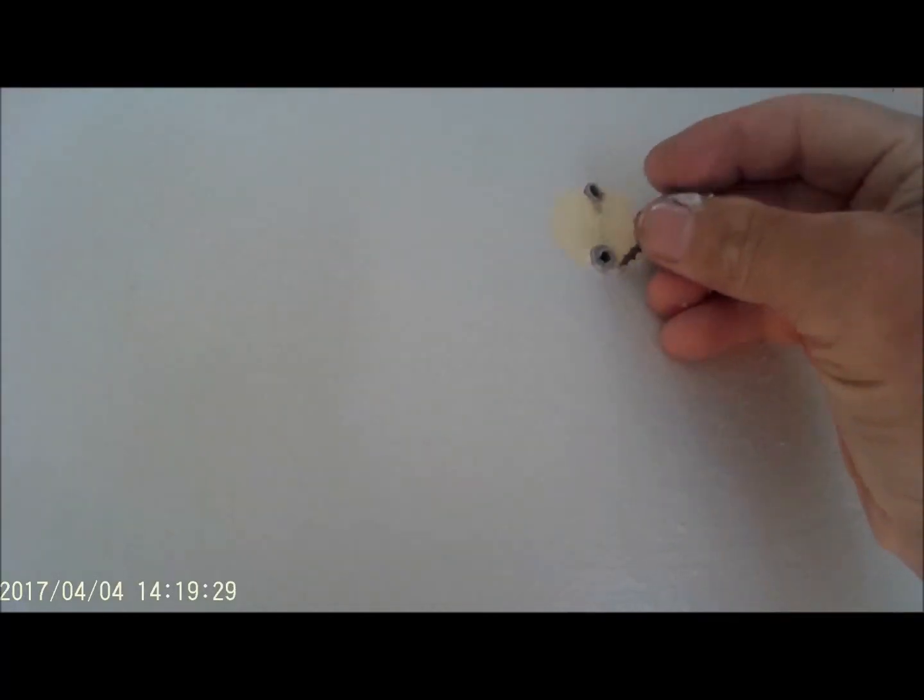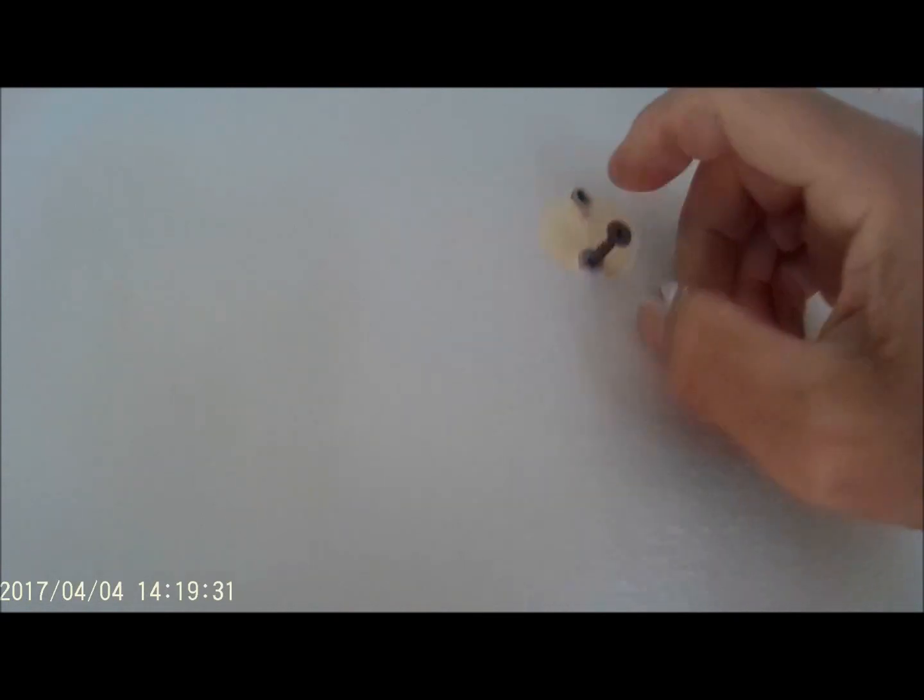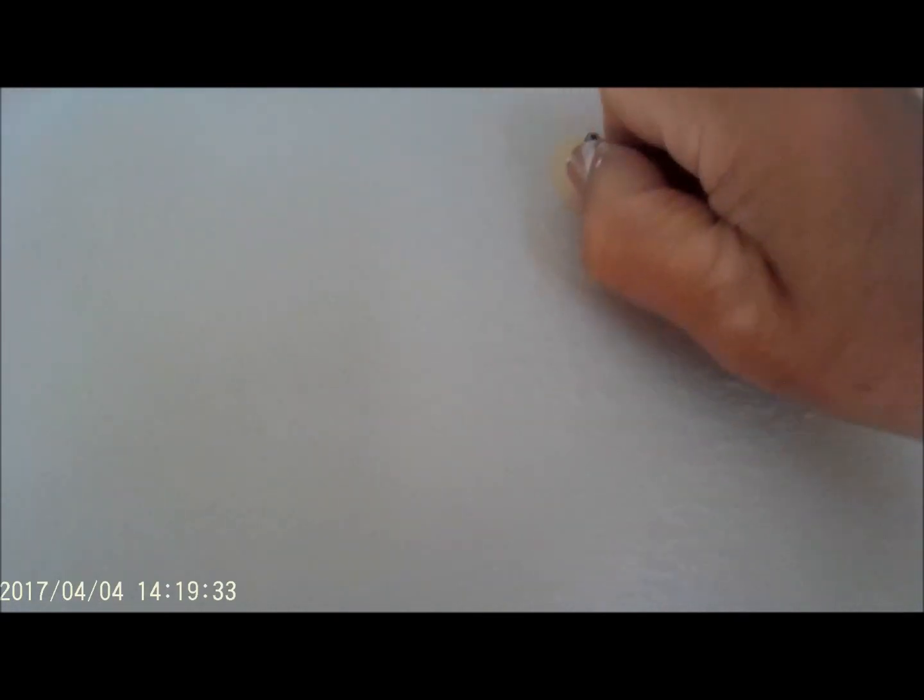Okay, these anchors are a little bit trickier to take out. You can't unscrew them. What we are going to do is screw this into the anchor and try to pull it out. I'm going to get a hammer. Here's my hammer. Now when you do this, you have to be very careful. When you put your hammer here, you don't want to put another hole in the sheetrock. So here we're pulling out the anchor, and it will kind of jack up the wall a little bit. Nothing more than just sort of pounding it back in.